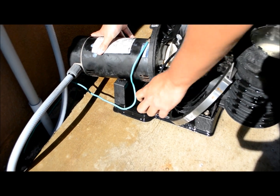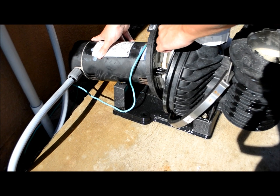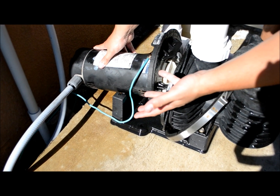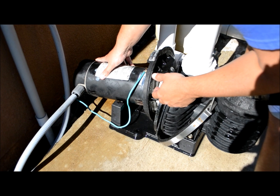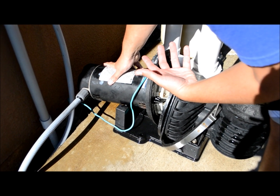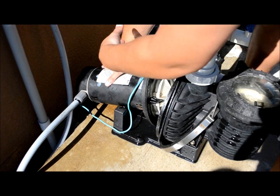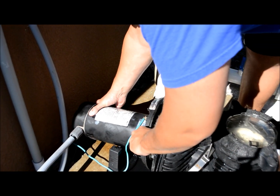You can see all the water came out and there's another O-ring here — it's a lot bigger and just sits there. This would be a time if you're in here that you may want to replace it; I've seen these anywhere from about five to sixteen dollars at a pool supply store. For this particular motor I've got the product manual and I'll post it underneath the video — it has model numbers for all the individual parts in case you want to look them up and replace them. I suggest you do the same for your particular motor.